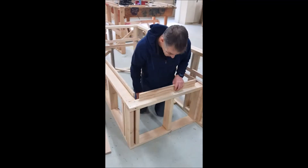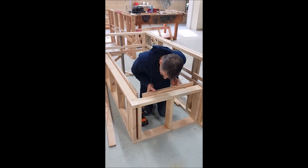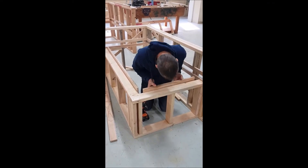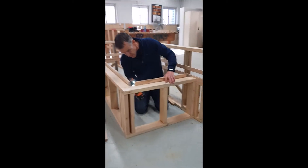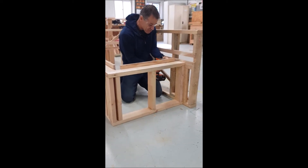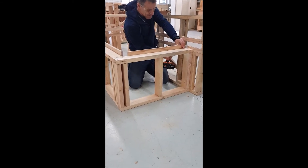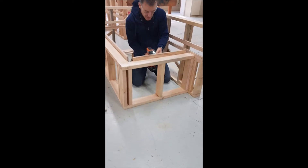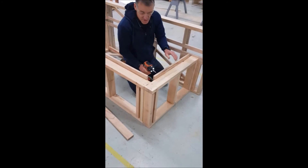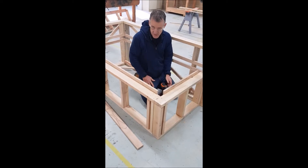Last one to go on is this short edge here. I'll just secure that on — we're securing it on with screws. This is going to come back off again. In the end I'll probably just run the plane on the top just to take that edge off to make sure that the curved edge underneath the bath frame doesn't foul up on that timber. So it's going to have a chamfer edge on it as we lower the bath in in the next video.